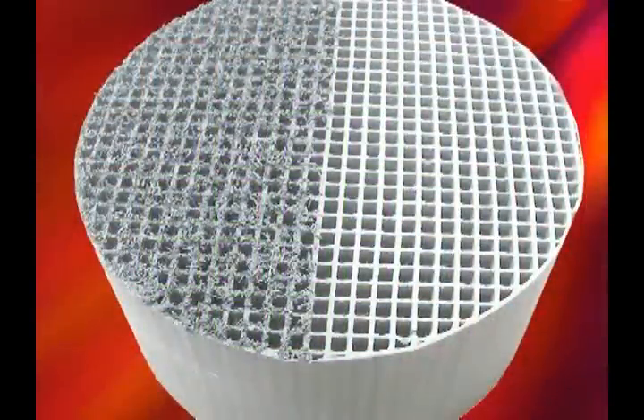Normally the catalyst works at such high operating temperatures that little or no maintenance is needed. The catalyst itself, once it's burnt the first time or lights off the first time, will have a light gray powdery appearance to it. However, if the catalyst does become masked or clogged with soot or fly ash, simply take a soft bristle brush, like a paint brush, and dust the surface off.